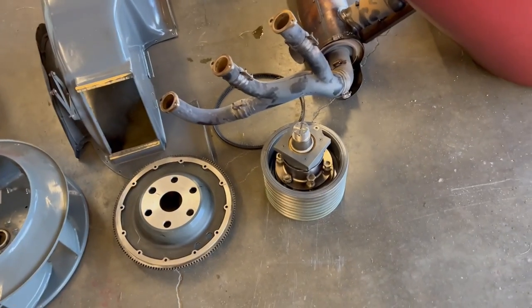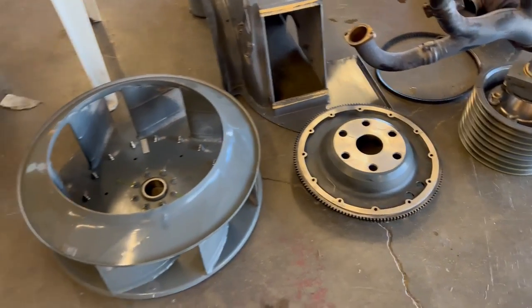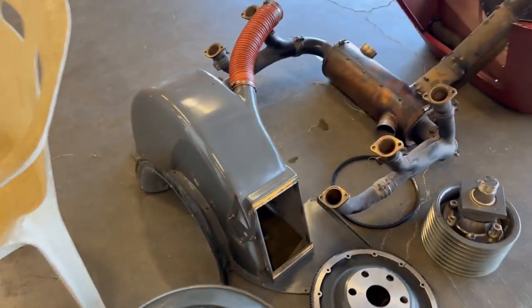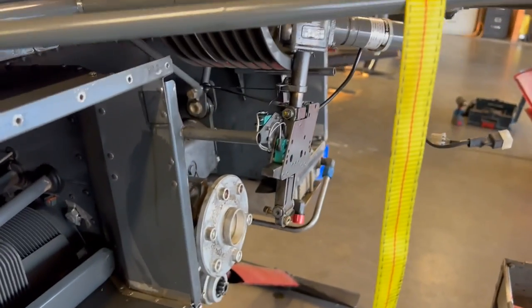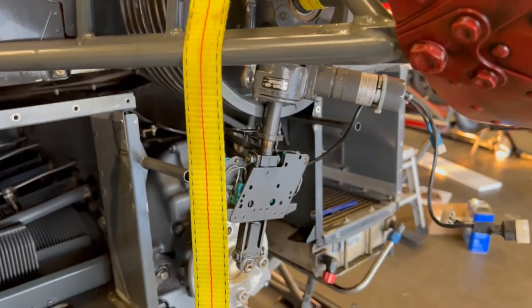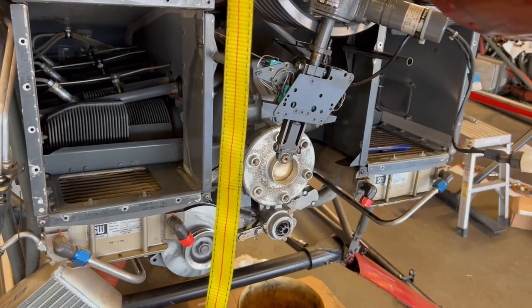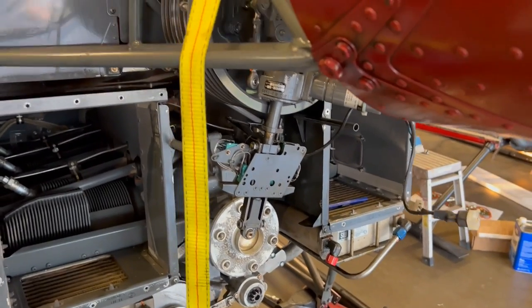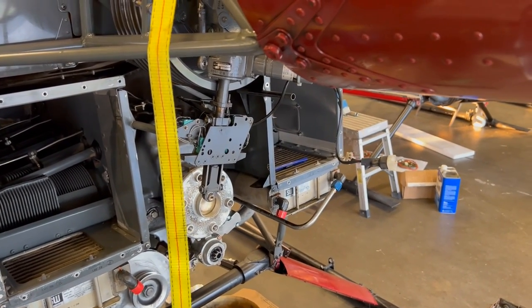The rest of the parts that came off of it — the lower sheave is in really good shape, there's the flywheel and rear fan. I'm not sure what he did with the belts, but I think we're just going to replace the drive belts on general principle, just because with them slipping that much. Even though the belts look pristine and you don't see any obvious chafing or damage, I think we're going to put a new set of belts on anyway.